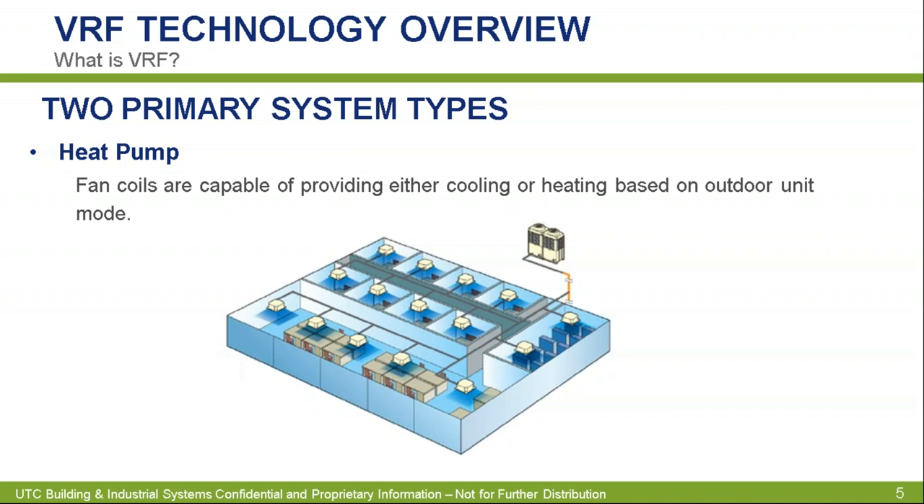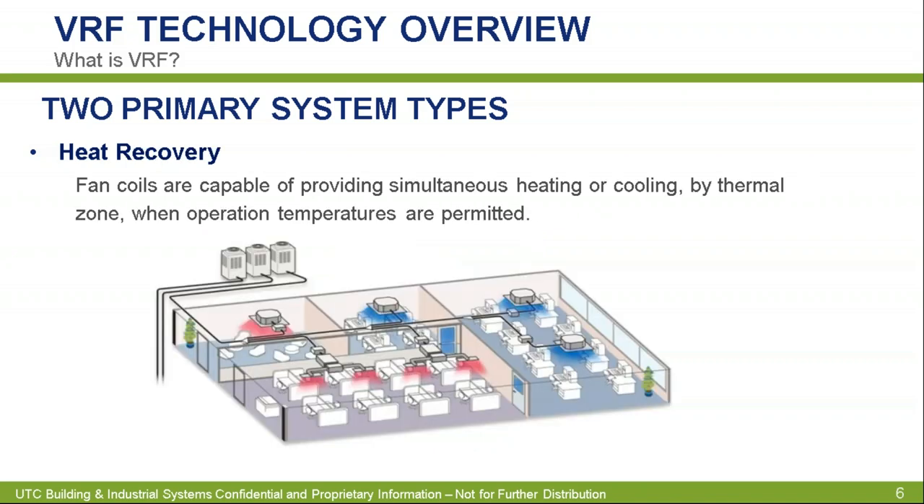When to use a heat pump system is when you have areas you're feeding that are all similar loads. If you have two different areas with very different load profiles — maybe one's on the east side and one's on the west side, where you're possibly going to have sun load in the morning on one side and not on the other — that's not a good application for a heat pump VRF system. Because if one area wants cooling and one wants heating, your system will have to continually switch back and forth between the two modes, which is not efficient and not good for comfort. So when you have those applications, you want to go to heat recovery.